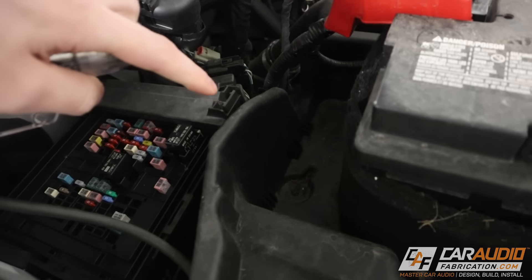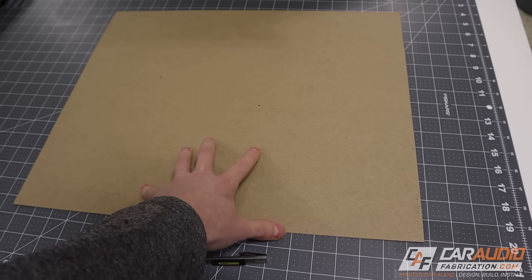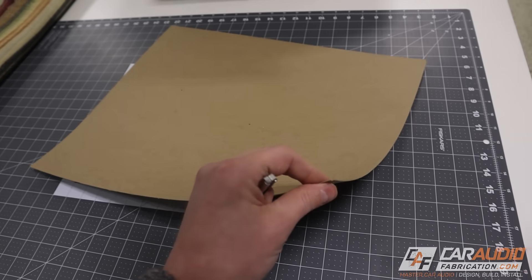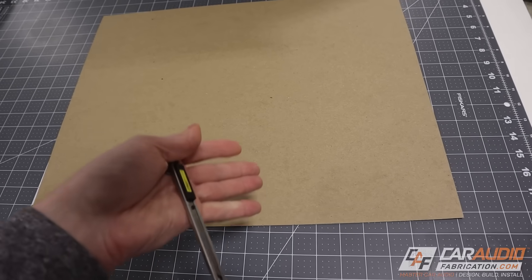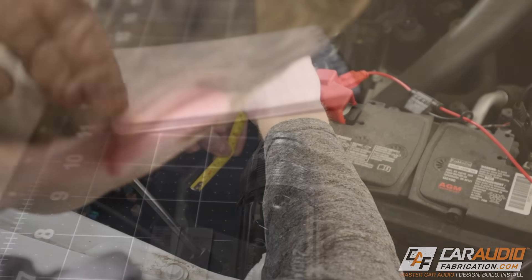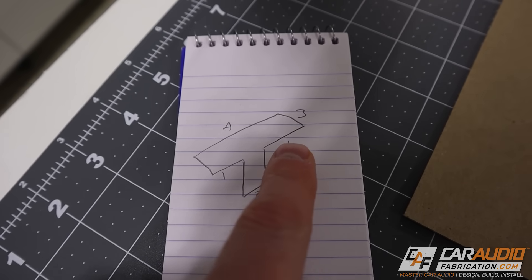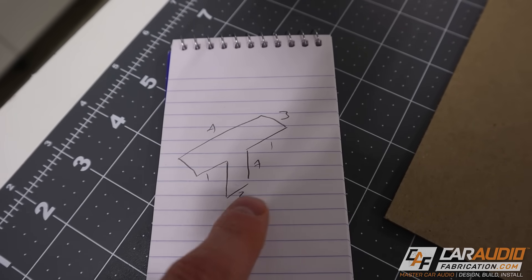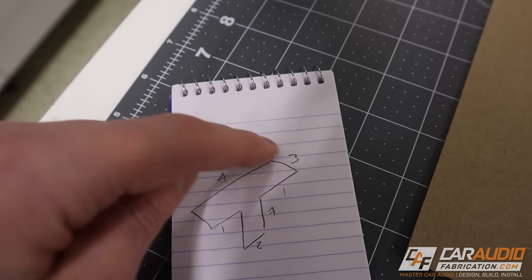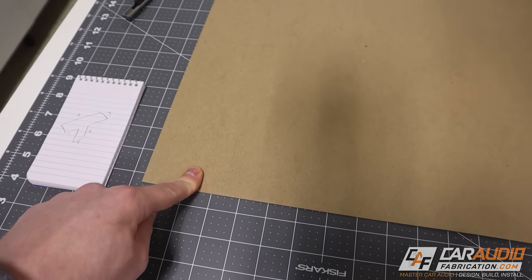I know I want my fuse holder right here, which means I'm going to have some sort of L-shaped bracket that bolts through into this. A great way to come up with a design before spending a bunch of time making this out of plastic is to just use a piece of cardboard — or in my case, a really thin cardboard called chipboard, though you could use part of a cereal box or any other cardboard container. I take some rough measurements, get an idea in my head, and start to translate that onto paper. There'd be a bend here going up four inches, two inches wide, then a platform about four inches long and three inches wide. I round each of the corners and then flatten the layout out to cut it onto cardboard.